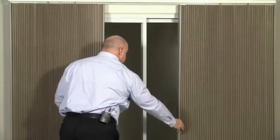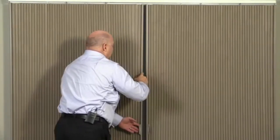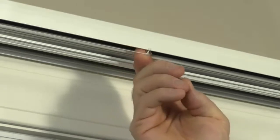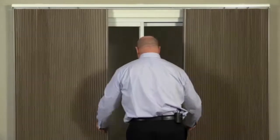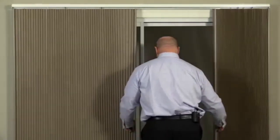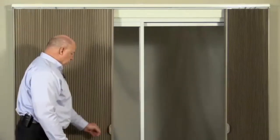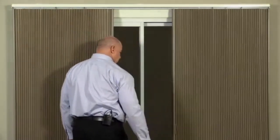Move each panel to the nearly closed position. Check to see if the moving rails are parallel. If they are not, they will need to be adjusted prior to tensioning the cords. Slide each cord tensioner along its channel in the head rail until the cord is taut. Fully open and close the fabric panels several times. This evenly distributes tension along the shade. When the cord tension is set properly, each moving rail slides easily and holds its position anywhere along its travel.